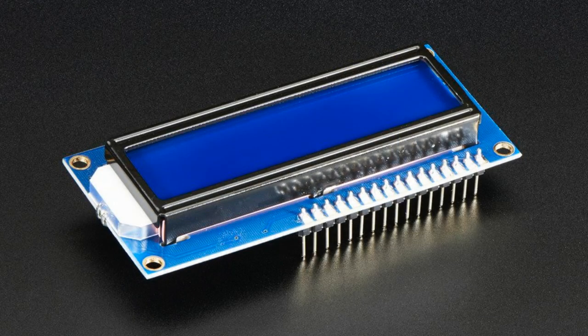Compare that to an LCD module — here's a classic 16 by 2 LCD module. It's really chunky. We get them with headers attached, but it makes for a much bigger build. You have this extra module that's a couple millimeters above before you even get to the LCD, and it can be up to a centimeter in height. Maybe for your product or project you want something very slim and easy to assemble — well, these will do the job.